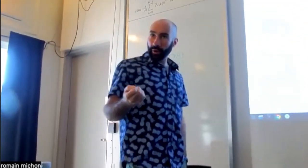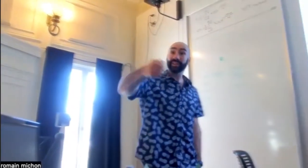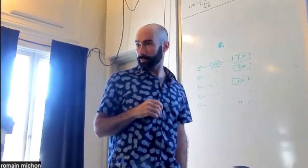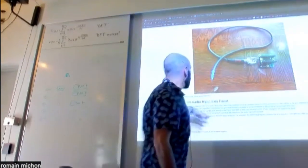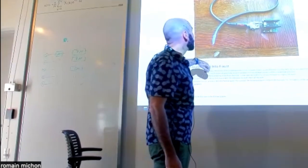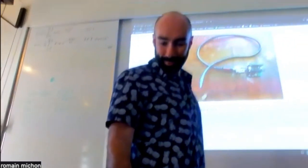Usually when you use a microphone or a piezo or anything like this, it has to go first through a preamp. Like on this mixer here in the room, there are preamps and you can adjust their gain. In the same way, the Teensy audio shield has a built-in preamp that you can configure from the Arduino code. Okay, so then you will solder this, and eventually your assembly should look like this. This one is bad, and those are COVID era pictures that I took on my kitchen table in France. At the time, things were a bit complicated, so we did what we could.